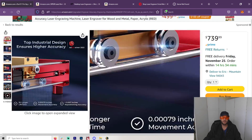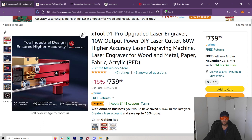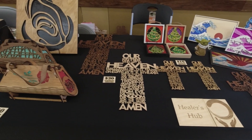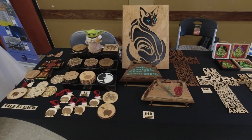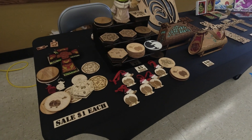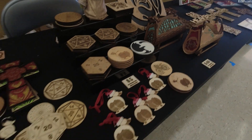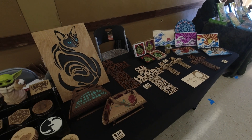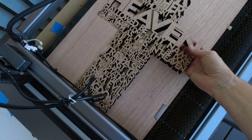Other things to think about when buying a diode laser: it is not, quote unquote, a real laser — meaning yes, it shoots out a real laser beam, but a CO2, if you're going to actually start cutting like half inch plywood, making really nice big pieces of art, or you want to make stuff to sell every week — honestly, you're just never really going to be able to do that with a diode laser. You can make a bunch of really cool stuff and take it to the farmer's market and sell it, but if you sell it all, there's no way by the following week you'll be able to replenish your stock. A lot of stuff takes two to three hours to make on a diode laser. They're just very slow, so being able to do any sort of production is very difficult.